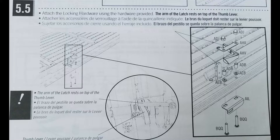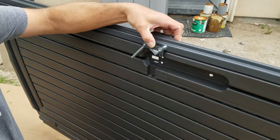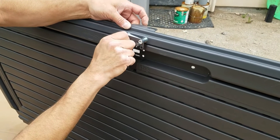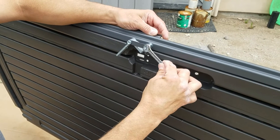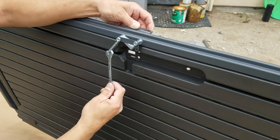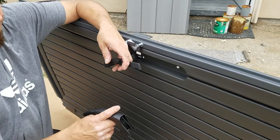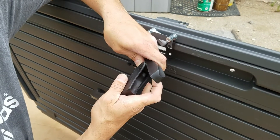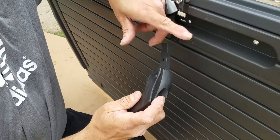This is how the door handle goes on. You put the door hardware according to the instructions through just like so — the names of these pieces are in the instructions. I believe that's a seven-sixteenths nut that goes on the end of these two seven-sixteenths bolts that go through the trigger enclosure for the handle, the right-hand door handle. I just give them a couple of turns with the open end wrench. There are two little spacers that have to go in there according to the picture in the instruction book — little spacers, and then it gets that plate and you have that little swinging loop. Here is your right-hand door handle; it consists of two pieces. I put the top plastic piece as shown — it has two little nibs. You just pop them into the edges that go all the way in, spread it open a little, put the nibs in, slide it down the little channel and it pops into those little holes.